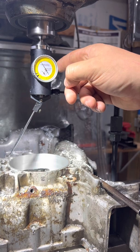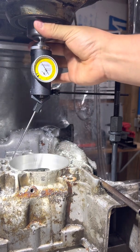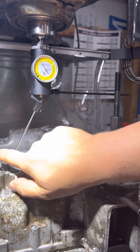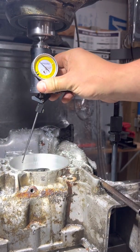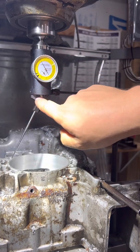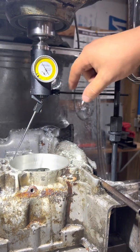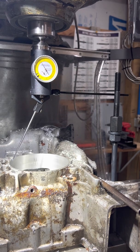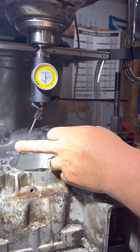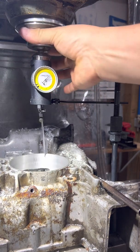This gauge is interesting because it operates with the mill on — it will turn. The way it works is it has a lever that translates horizontal motion into vertical motion. It's got just a little cam under here that can spin all the way around on a ground surface underneath. This gauge has a little arm right here that contacts a stud. You preload it a little bit, drop it down into the hole, let it go. You can get it close to start with — we know we're not wildly swinging the needle.